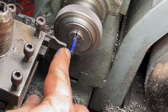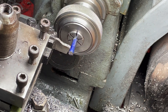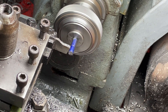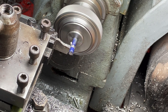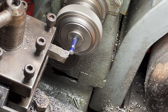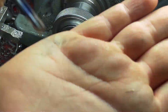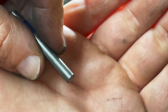We've got the spring pin in the collet now. The first thing I'm going to do is plunge in with the parting off tool at the end of this quarter-inch threaded section to create the gutter for the thread, and then we'll trim the end to size and thread it. Then we'll switch back to the three-jaw chuck after this. There we go - there's one thread. We need to repeat that and then we're going to attack this end.